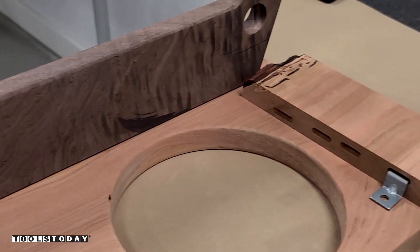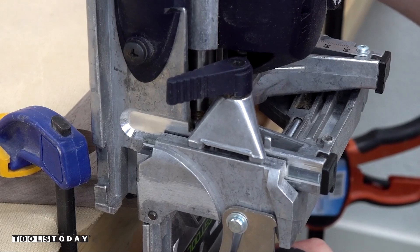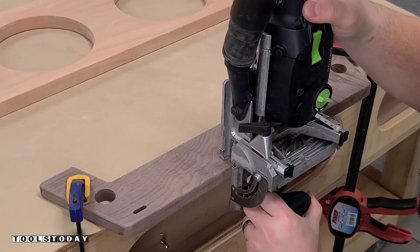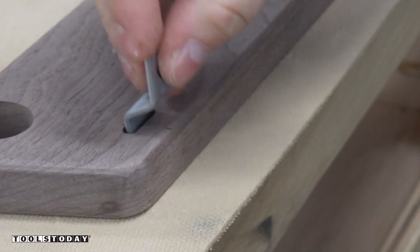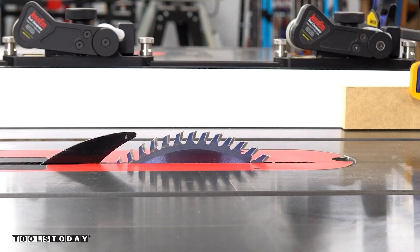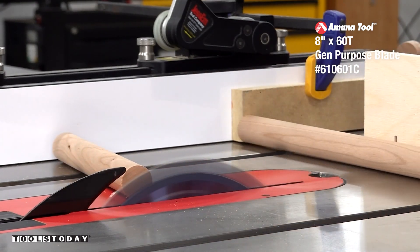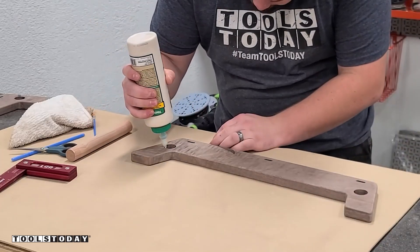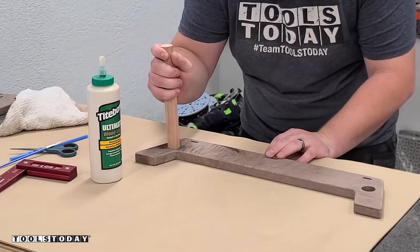Now we need to think about joining these two pieces together. There are a number of different ways you can do this. I chose to use Z clips and the Festool Domino to drill out the pockets for them — you could also use a biscuit joiner, a router, or even pocket holes. These Z clips are really nice as they fit in there and attach to the top while still allowing for wood movement independently on both pieces. Now that's all drilled out, we can get the dowels all cut down to size using a 60-tooth general purpose blade on the SawStop table saw. We got all of those done and now we can use some Titebond III wood glue to get everything assembled — making sure there's plenty of glue in the pocket before inserting the dowel.